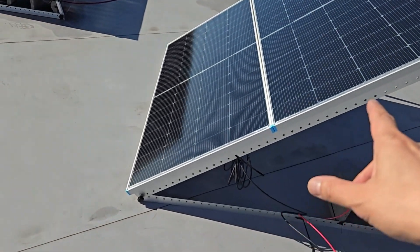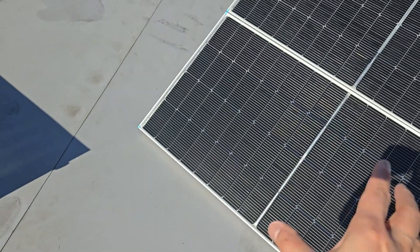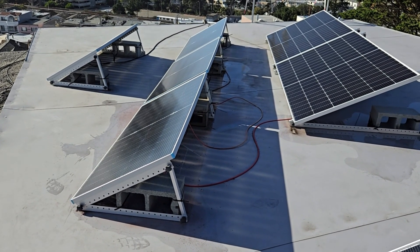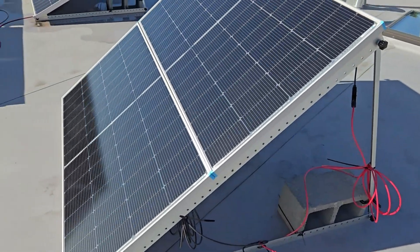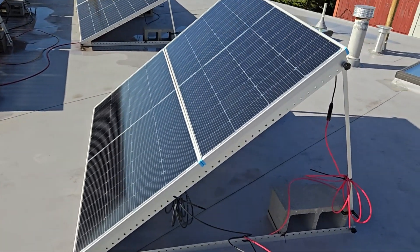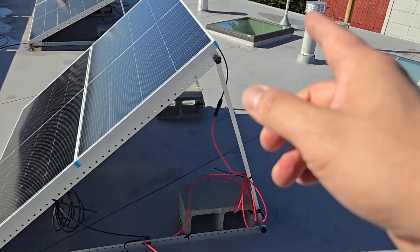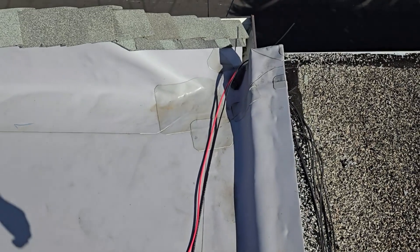It's the N model, 250 watts. These panels are basically the same size as the 220-watt Renogy bifacials — those are 220 watts; I would have gotten those if they'd been available at the time. By the math, the total is 1,560 watts, but I've constantly seen my EcoFlow Delta Pro fill up to 1.6 kilowatts max. Right now in November, out of these two panels it's getting about 451 watts. I expected good things, and I'm getting reflection from my TPO roof too, with the wires running across the house.